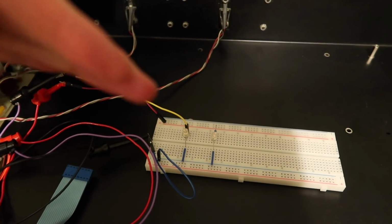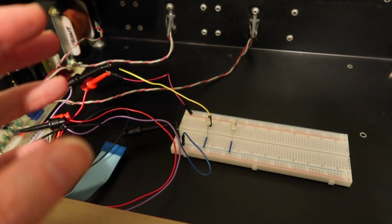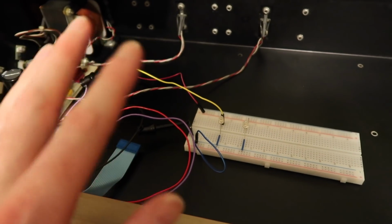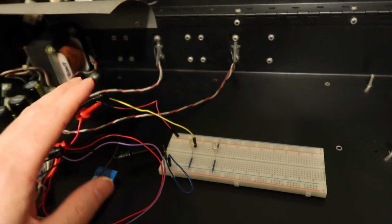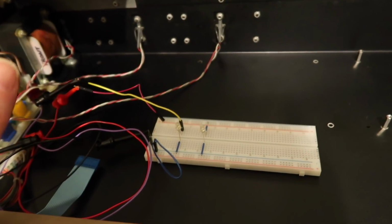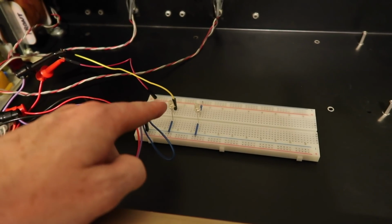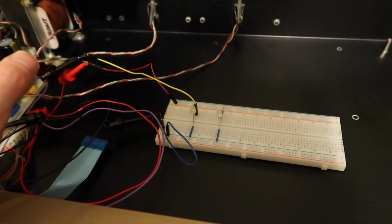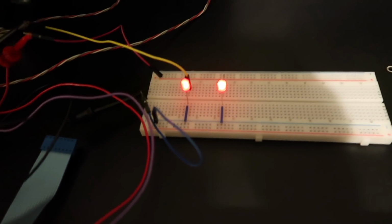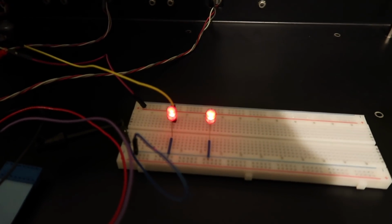Now, during that time when it's fading out, we'll get to an area where the digital chips won't quite know whether they're on or off. They'll be like in this in-between state, in a no man's land. And that'll happen at slightly different times for slightly different chips as well. So the whole circuit can go a bit nuts. But because we've already disabled our write lines, those sporadic ones and zeros that happen on the data bus, they'll be blocked. So let's just view that again and just have a look at the slow fade out of the 5 volts and how fast the power up monitor line turns off.